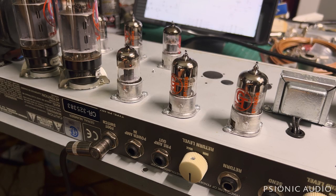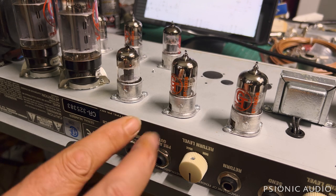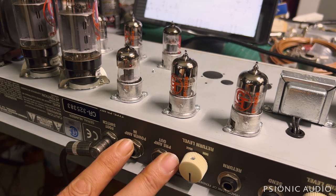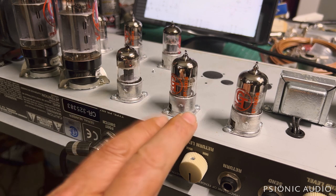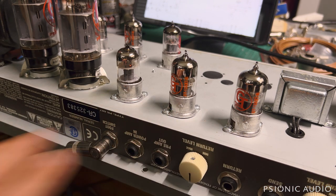I sorted out some very bad preamp tubes in here — had two really awful tubes that made the amp oscillate and howl, and they had the wrong tube for the phase inverter. Got a 12AT7 in there now, which is correct. The amp is still much noisier than I'd like. A lot of it is due to the way the effects loop is implemented. The effects loop is a solid-state op-amp derived splitter — it's low-impedance output based on the op-amp circuitry. This loop on some models is footswitch selectable, this one is not. Some models also have reverb, this one does not. It does give you independent control over send and return levels. But the end result is a lot of additional noise that I think the amp could do without.